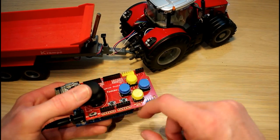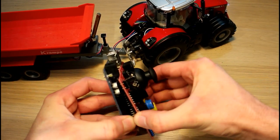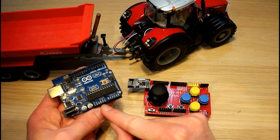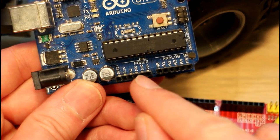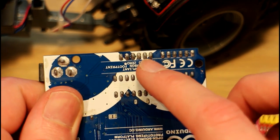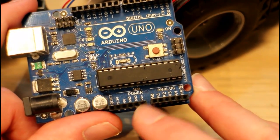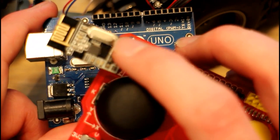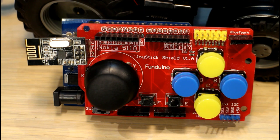If you wanted to build a battery pack into your controller, you could use the raw pins directly — even solder to them. The two pins you want are V-in and ground. You solder your battery connections to those two pads, and that powers your controller. The V-in goes to the voltage regulator, which then provides 3.3 volts for your NRF24 radio module and the Arduino.